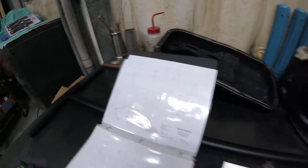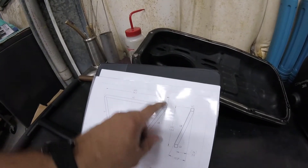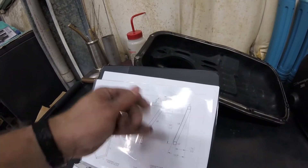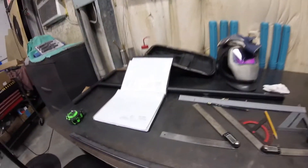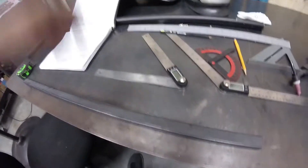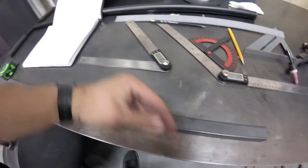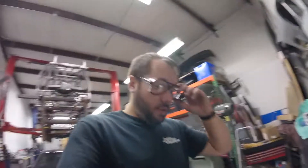It was not right. Basically I had to set it on 40 degrees. This angle is 130, which is the opposite of 50 — minus 90 degrees is 40. It's freaking confusing. I think I'll get it. So I got the one cut done at 50 degrees, I'm about to do the other one. To figure it out, I ended up just drawing my line on the tube with the angle finder and then lining up the blade, looking down on it. That's how I figured it out. These mad angles are difficult, huh? Life is hard. It's even harder when you're stupid.